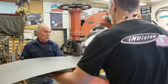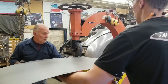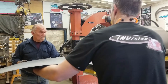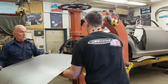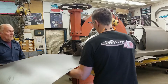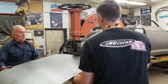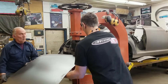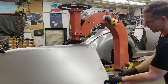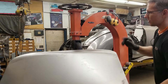For the rear trunk skin we're starting by just breaking the primary roll that goes down and around the bottom of the trunk skin. This area is going to have to blend into the two side pieces so we'll have to match that up afterwards. Just let the gravity of this give us a starting point. If this were all one section of trunk skin we'd have to go all the way down into those side pieces and stretch the whole center — quite a lot of work. This kind of simplifies things, so we're going to switch over to the solid anvils.